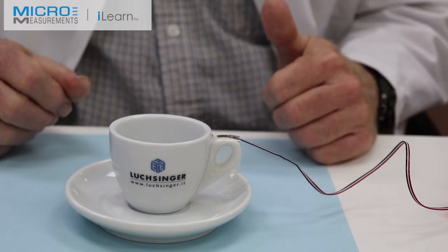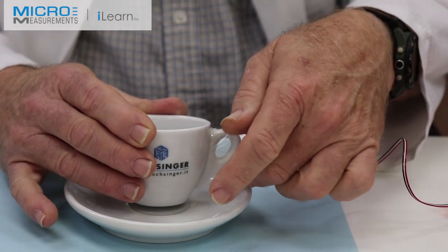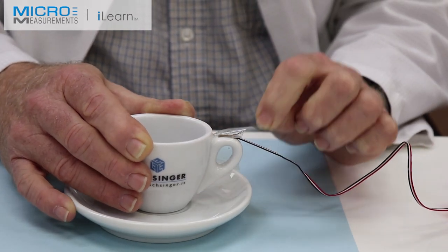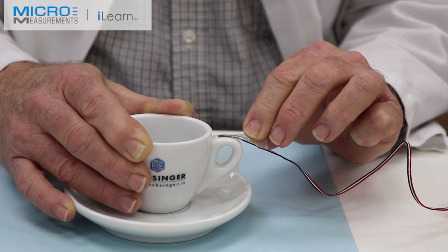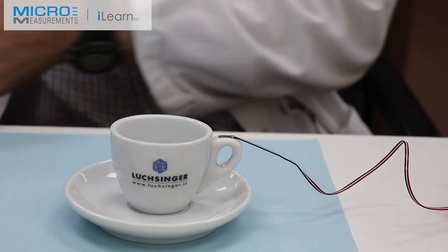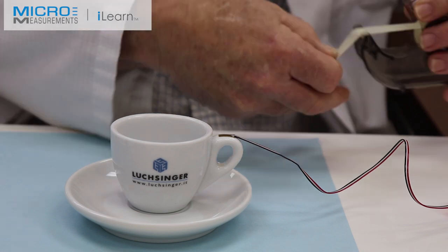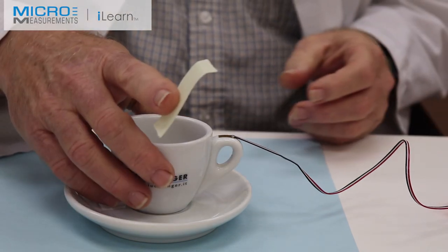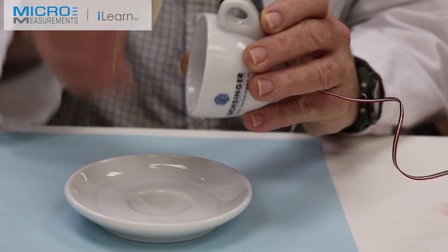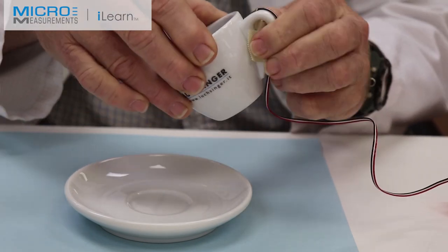I've finished my one minute under the thumb and allowed it to rest for two minutes, so now I'm going to remove the gauge handling tape. As with any strain gauge, you want to take the tape and pull it 180 degrees back on itself, putting the adhesive into shear as opposed to peel. Note I'm leading it toward the lead wire as opposed to away from it. The gauge appears to be fairly well bonded. To avoid any real damage, I'm going to take some PDT paper drafting tape and tape this down as a strain relief — don't want to put any extra strain on the lead wire system because the gauge is susceptible to being pulled off at this point.